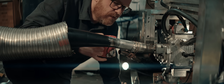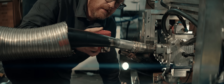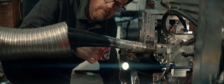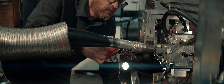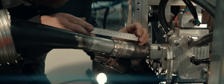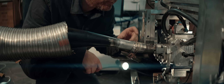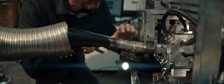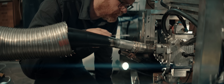Welcome back to my garage. Last time we did some runs with just the exhaust stub and then with the megaphone in its original form, and we lost like 3-4 horsepower. Now we're going to test with an extended megaphone. Added 140 millimeters of length to the header. It's extendable and now it's as extended as it can be. Let's do a few runs with this and see where it takes us.